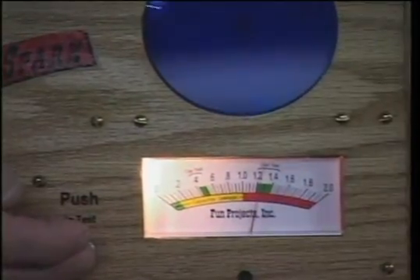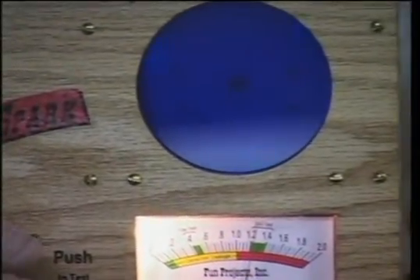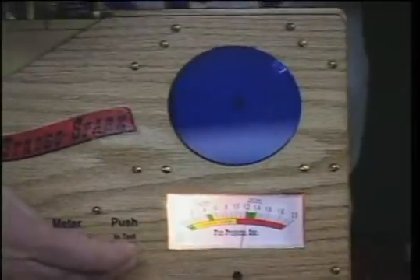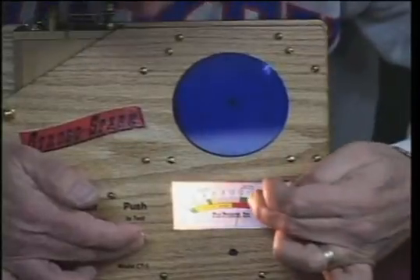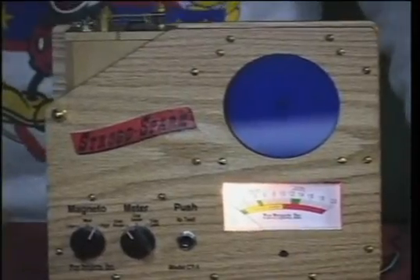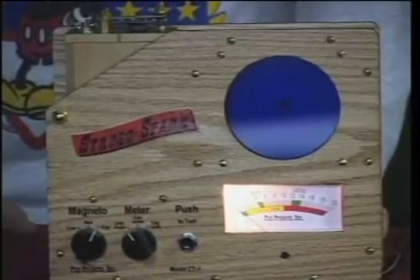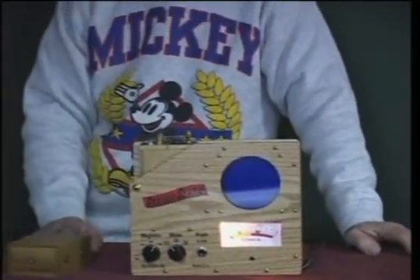Now I'll come over to the current and press it — and you'll notice there's double sparking. If you look at the display you can see an erratic pair of sparks occurring at each location. This can be somewhat exacerbated by changing the magneto strength. The current reading may appear relatively close, but it's probably off because we're actually measuring two split sparks and not getting an accurate reading as we would with a single spark. The first thing that must occur is we must get the coil to operate with one and only one spark — then our current reading is genuine and we know it's valid.